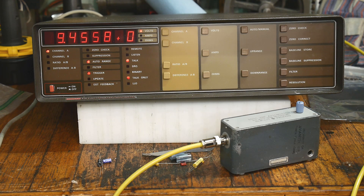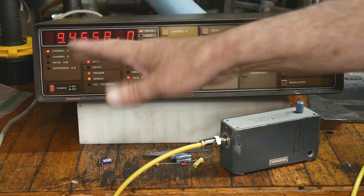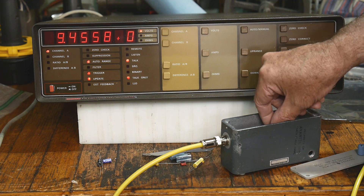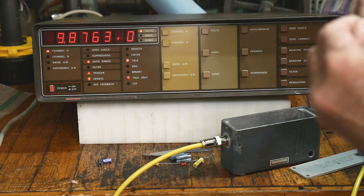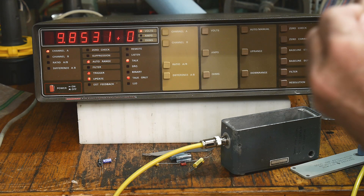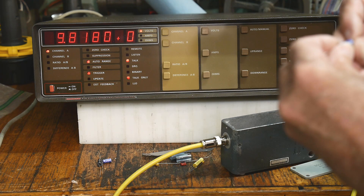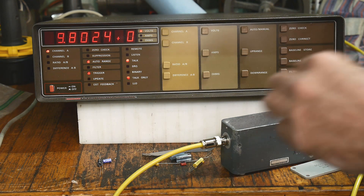It really is stellar. That's pretty amazing. With electrolytic capacitors you can actually see the numbers go up a little bit sometimes too — electrolytics are crazy. But look at this thing, it is just super, super stable. You'd be here all day waiting for this thing to leak. So what kind of capacitor was that again? It is a Nichicon PET, it is polarized, and it is 100 microfarads, 16 volt.